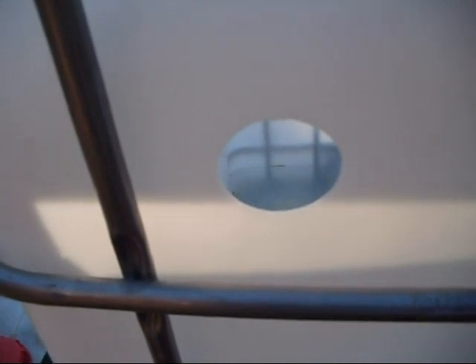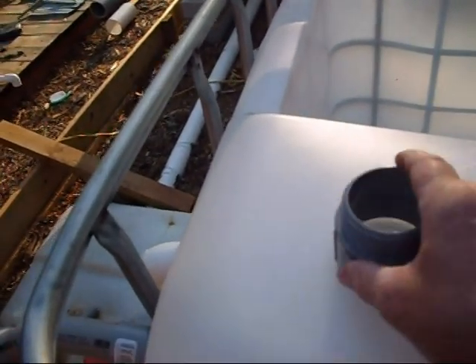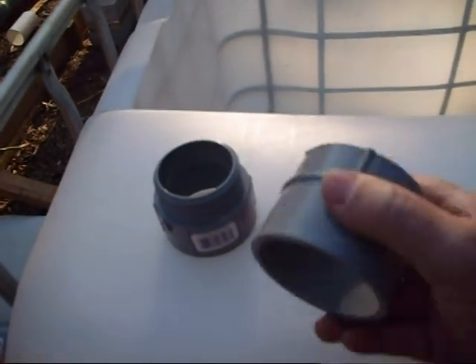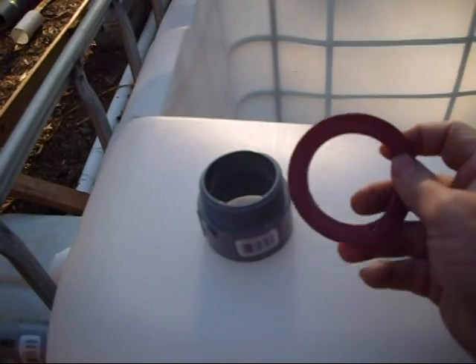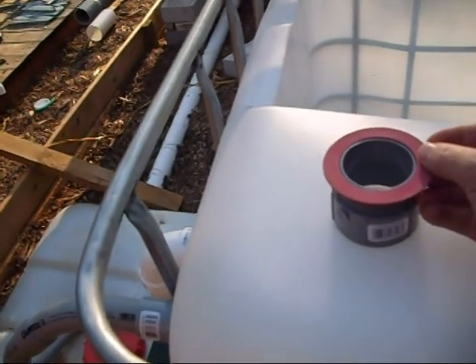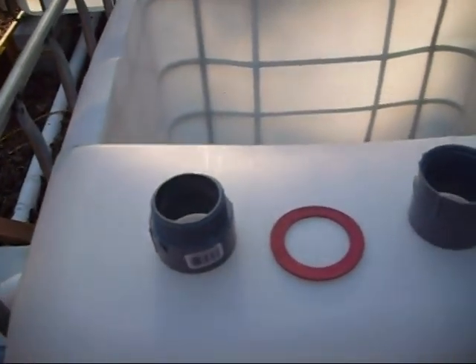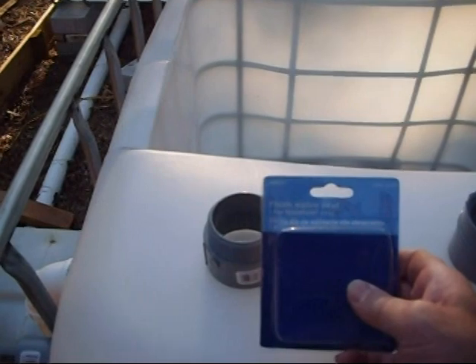Back to the penetration. What I have here is a two and three-eighths inch hole. I cut it using my Dremel tool with a circle cutter — you can get a hole saw, whatever method you use for making a fairly clean, nice hole. Two inch male fitting for two inch PVC, two inch female for two inch PVC. And this nice, soft, flexible rubber washer that fits just a little bit snugly over the threads — it fits a little snug, but it flattens out just fine. Flush valve seal, available in the plumbing department.